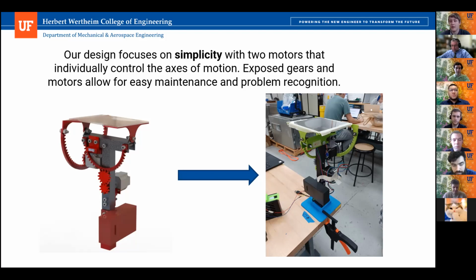So I think, of course, yes, it would wear more quickly compared to other groups, but our gears are also larger compared to other designs, so they're less likely to break apart. Some of the other designs we looked at the beginning of this project used linear actuators, which could be a bigger problem, especially if sand or other particulates are an issue. Those would be a lot more susceptible, and there's not as easy a way to hide those from the elements as gears would be.